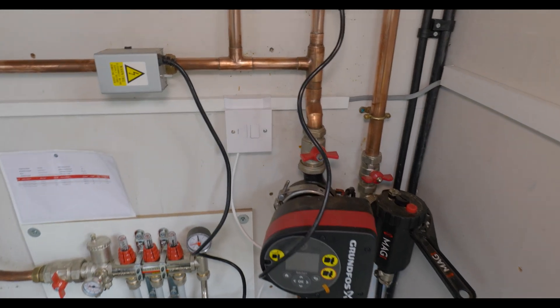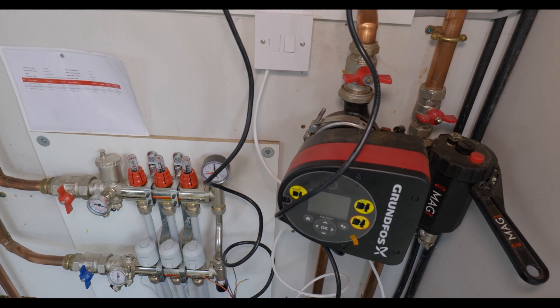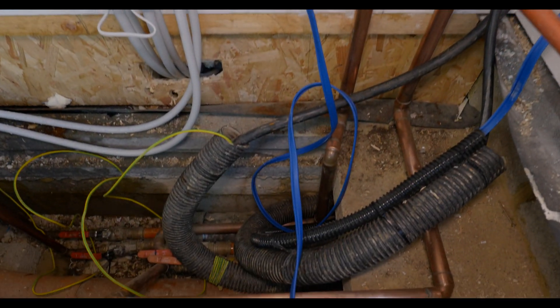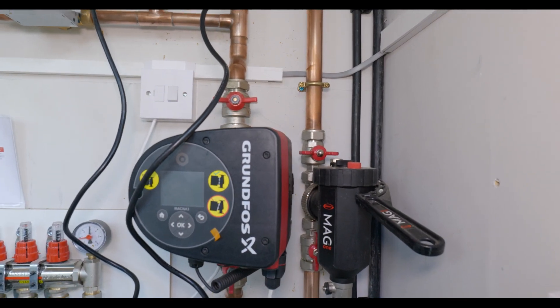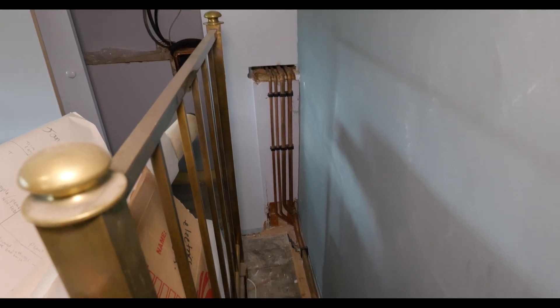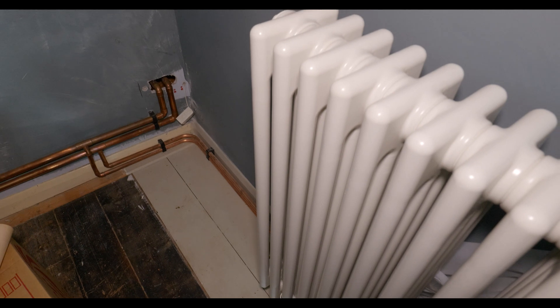We're about to start filling the central heating system. I've temporarily wired in the pump because the electrician hasn't been yet - because it's running off a thermal store, it only really requires the pump to be operating for me to manually start heating up the system. I've turned the flow and return on from the barn into the manifold where the extension is, and at the moment I've just got it isolated above the filter and the pump, so we've got one final check inside before we start filling it up. This is where the flow, return, hot and cold come into the building - the central heating run goes along and punches through that wall there, picking up the new column radiators upstairs and reclaimed cast iron rads downstairs.